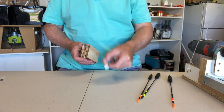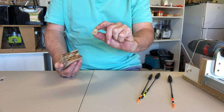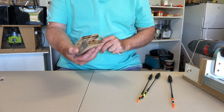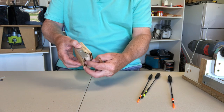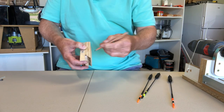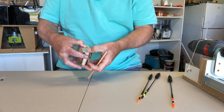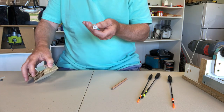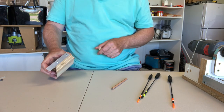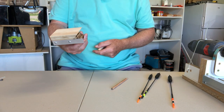First, we have to drill a hole through the center of the balsa wood. You can try to do it by eye, but that tends to be slightly off center. I've made a center finder — a ten-minute job using two bits of plywood and a strip of metal. You put your dowel in, mark it, turn it around, mark again, turn once more, and you now have a perfect center on the dowel. I'll put a link in the description so you can make one of these yourselves.